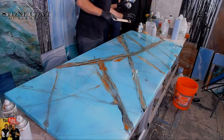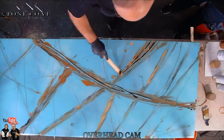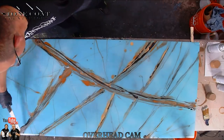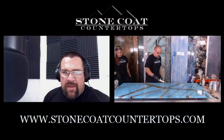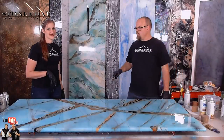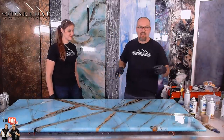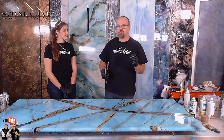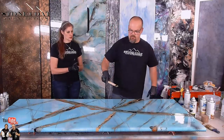I'm going to finish with some more black. Here's that warm caramel — it's a little bit different. Christy asks: can you tint the quick coat with your base tint? Yes, you can. We do not recommend using the quick coat as a top coat or a final product — it's going to amber and patina and yellow on you because it's not meant for UV. We designed it as a glue to adhere MDF together. It is very fast drying. Do not make that your top finished surface. But yes, you can tint it and then it will hide the fact that it's yellowing.